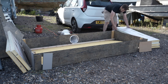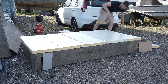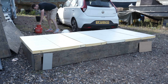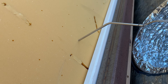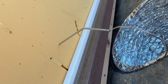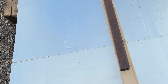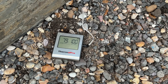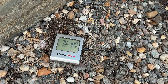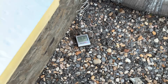I realised, especially at the air intake end, the thermometer reading air temperature wasn't really that indicative of the foam's lived experience. The perforations in the foam can be used for the probes, measuring not air or surface, but inner foam temperature. The initial results were intriguing — the exit thermometer is heating up faster. We've learned that the air temperature near the duct is hottest, but the nearby foam is taking longer, presumably due to airflow and the heat not being allowed to pool in the area. The exit reading stalls at about 120 degrees, and we wait a few minutes for the other end to catch up.